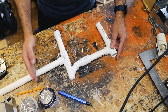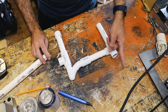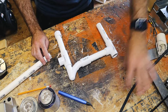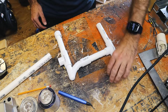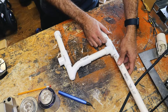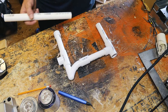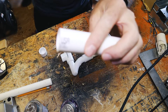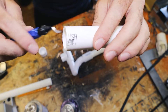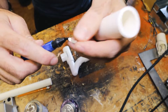I'll cut one more piece from my two-foot pipe to extend this down into my pump that pumps the condensation out. You may just have your line running directly down and outside your house — either way, continue your pipe down however far you need it to go. One other thing: my cuts came out pretty clean so I don't necessarily need to deburr, but if you cut yours on a chop saw you'll want to deburr and clean up that edging.